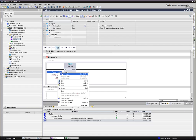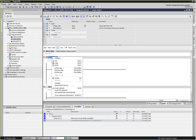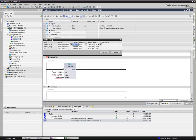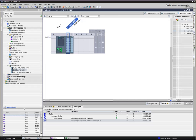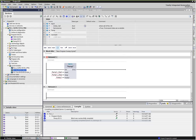I can go in here and define these tags now. I can do them individually, or a neat trick is that if I look at the top of a network and say define tag, it gives me all of the undefined tags that are in there. We can actually do them all at once. So what I want to do here before I do that is let's take a look at our actual PLC local modules. If I look at my input, for example, there he is. I'll see here I've got all these digital input points that are not assigned yet. If I go in here and assign them,